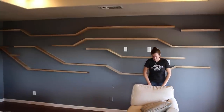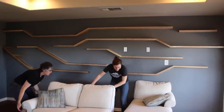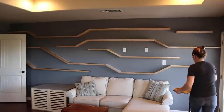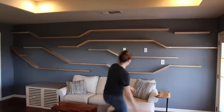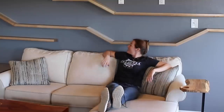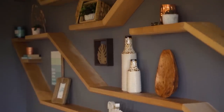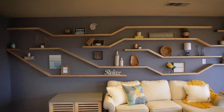Honestly, if I were doing it again I wouldn't go with solid wood, because now I understand there's no way to make it look perfect unless your wall is dead straight. Instead, I would go with a torsion box design using quarter-inch MDF as a top and face, then lay down maple veneer — the framing can bend to the wall and open gaps where required, but the veneer would make it look flawless. My cat's going to love this. Either way, I can't tell you how much I am in love with the results of this project — it not only changed the wall but also my entire space.